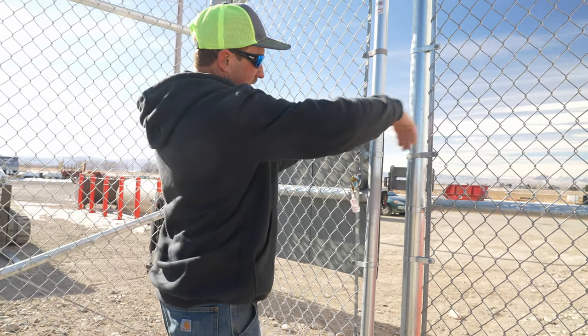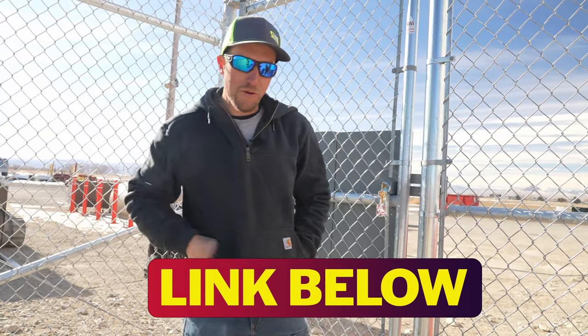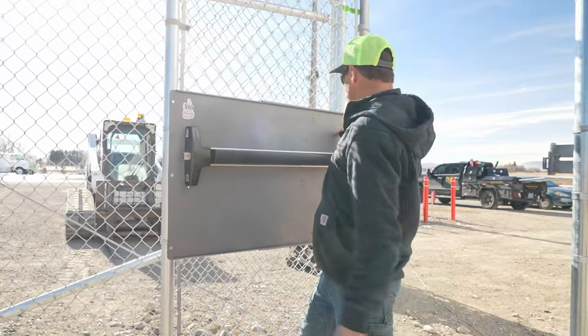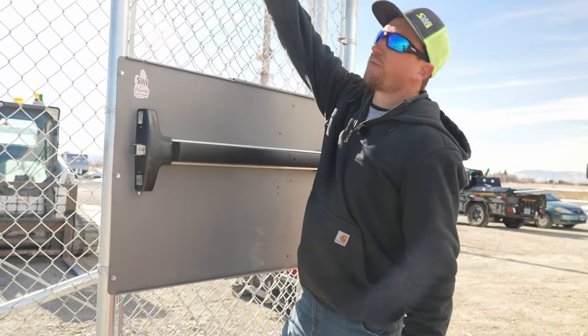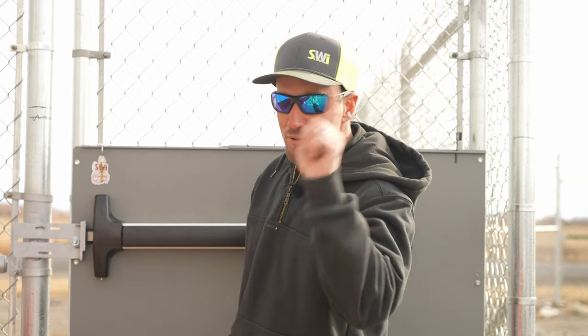It is going to come across and cover this face right here. See the link below if you're in need of one of those as well. You can also put some steel across here — you can either weld it or screw it. It creates a barrier if somebody wants to try to reach something over the fence to try to depress that panic bar. Hope you guys enjoyed the video. Don't forget to like and subscribe — we are Wyoming's Fence and Gate Company and we hope you have a good dang day.